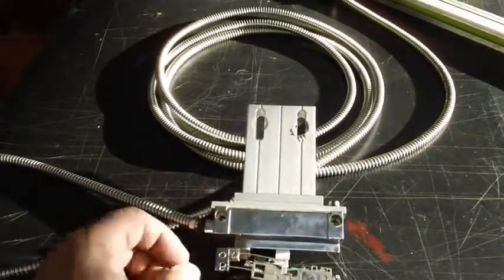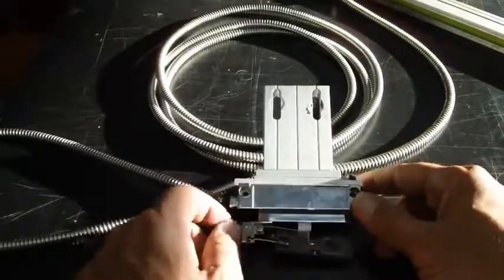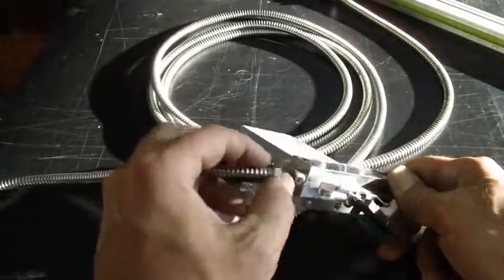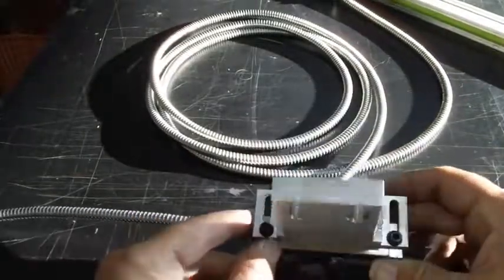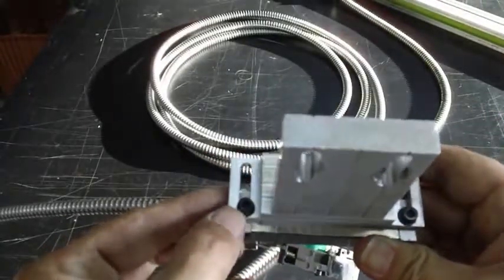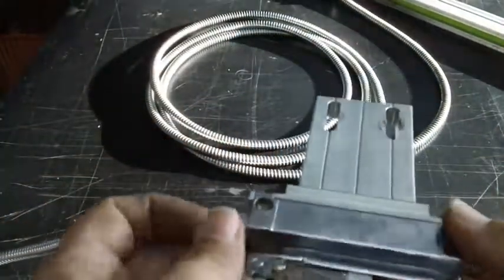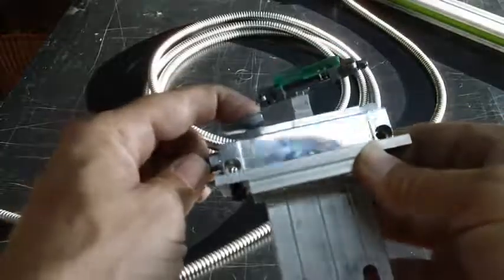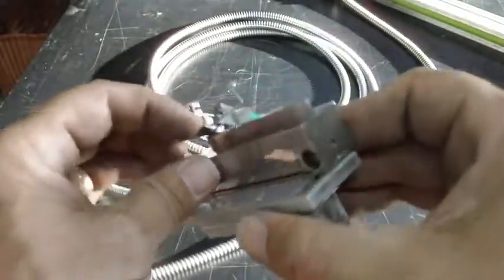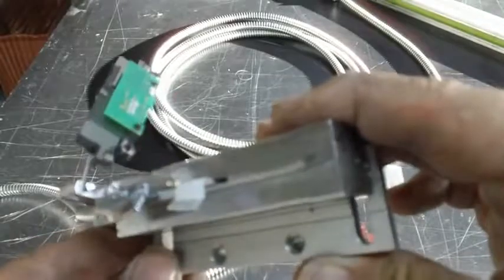The biggest challenge we've got is trying to straighten out this pot metal and get this thing lined up the way it's supposed to be. So we're going to have to pull out that broken piece of threading for the jam nut fitting — or the armor cable. Get all the wiring out, take off these cap screws, and pull this whole metal piece off to strip it down to its bare components. And then we've got nothing to lose, so we're going to try to straighten it — which may end up snapping off. And if it does, we're going to have to fabricate a new piece and find a way to reattach it onto that slide.